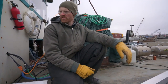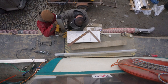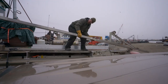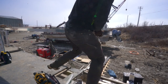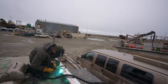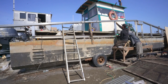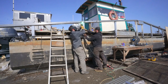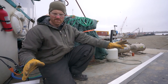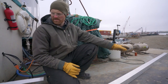Here's what I was thinking for the build process. We set this box up on the single post at the height that we want and then set our chute — aiming right at the box and also clearing the hose. We'll have to get two chutes and weld them together, clamp them together. We got this long triangle-looking thing, and then we just fill in the posts — measure up, measure up, measure up. At that point we keep adding gussets, parts and pieces, and once we like it, we weld it out.